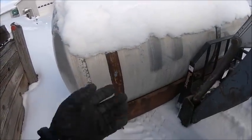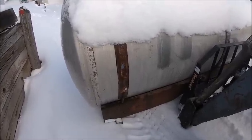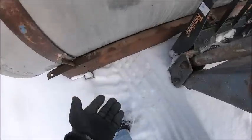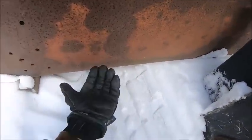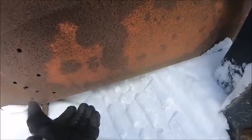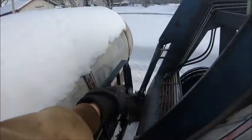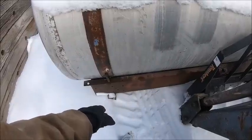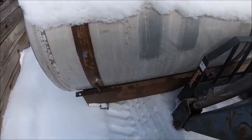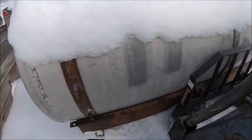Got picked up in the air, I got to looking underneath it, and there's a couple things that I want to straighten out and weld back together real quick. This plate has a 90 degree on it that's bent back. There's probably about a 5-inch leg underneath there, and over there on that side it got tore and it's bent up, so I want to bend that back down flat and weld it back straight. I want to cut these box tubes off so it'll set down in the gear. There's just a couple of small things I want to straighten on it that I think are going to be easier to work on upside down.